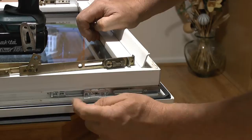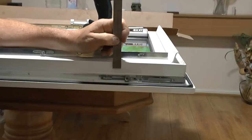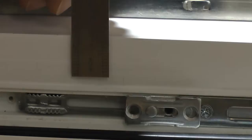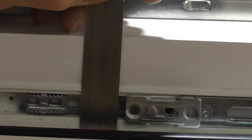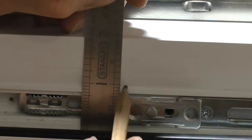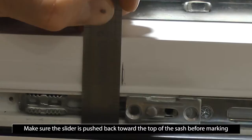Dealing with the bottom drive gear first on the corner, we will need to mark the position where we will need to cut the main drive that comes down from the handle. To do that you usually leave approximately one and a half to two millimetres from the end of the slider — ensuring that the slider is back — mark it here, and obviously doing exactly the same to the top of the sash. Having removed the drive gear that goes on the handle from the height box, you determine which way around to put it in three ways. If it's a very short window you could find that there are no rollers at all on the bar; if it's a taller window you'll find that there may be two, or alternatively simply just one. But for best guess every time, put the writing the correct way up from the bottom of the window to the top — so 'TOP GP' should be at the top.